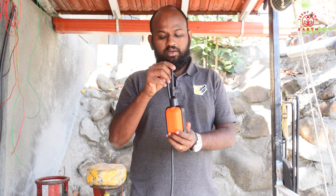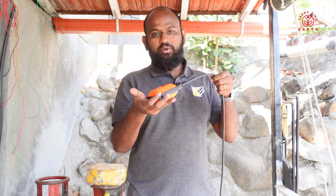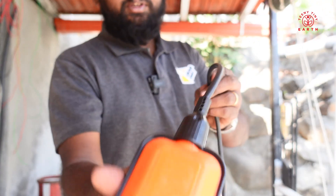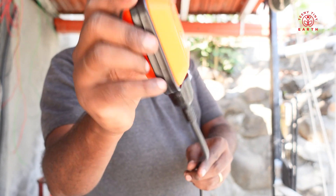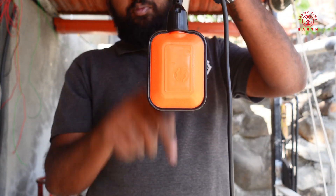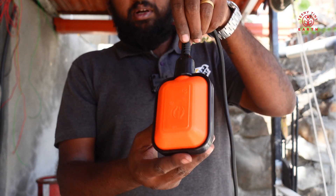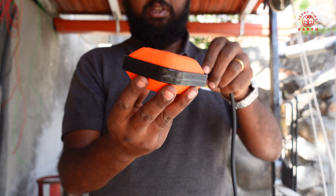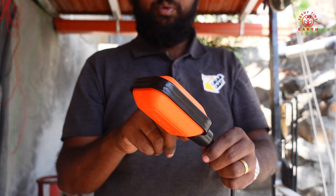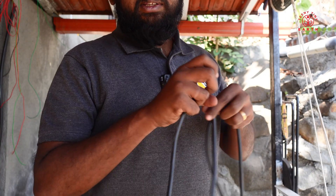Here I have the float system. When the water rises it rushes on top because the float is filled with air, so it floats and comes up to the top. There is a solid ball inside which moves when we change the position. So when it is down, it is not pressing the switch, letting us know it is in down position. But as the water fills and it comes up, the ball rushes back and pushes the switch to let it know the water has filled.